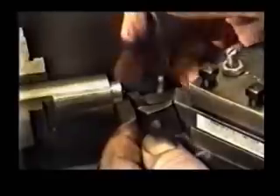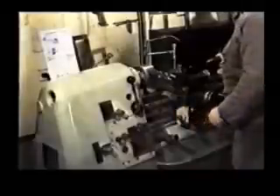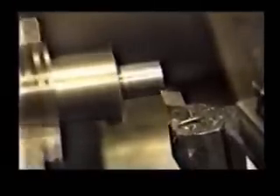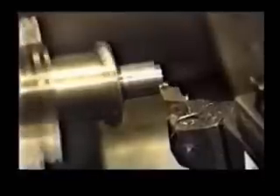One may well ask: won't it slip? Well, let's see it at work. Firstly, a roughing cut using the normal procedure — correct feeds and speeds for end facing and shoulder facing. The tool is set so that only the point is in contact with the work face. To achieve this, loosen the tool post, rotate until there is clearance in one or both directions, then clamp up.